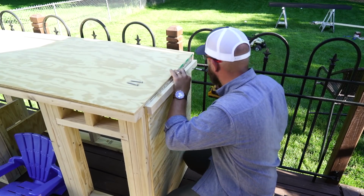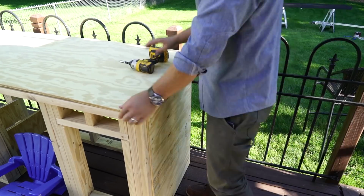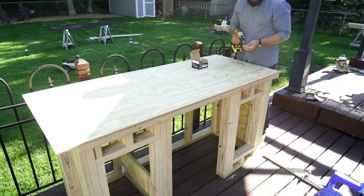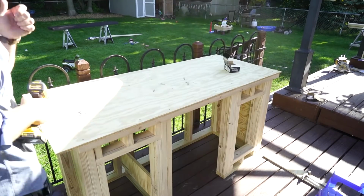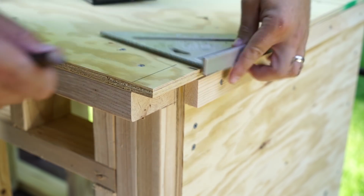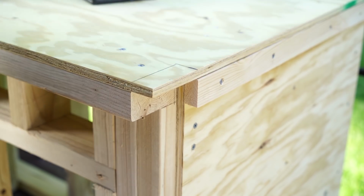The front I know has plenty of strength with all those 2x4s that are close together, but on the sides and the top, I'm going to be adding a layer of half inch plywood over those studs. Then I'm going to secure the pergola post to the frame, and then I'll add a sheet material called Hardie Backer between those posts on the side and on the front and anywhere that the tile gets attached. The Hardie Backer is a cement board, and you need to put that down before applying mortar and tile.